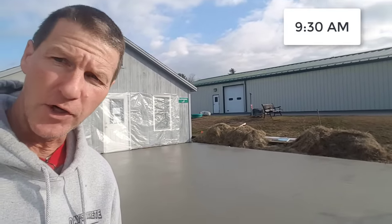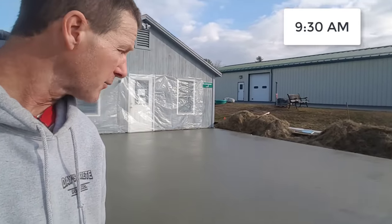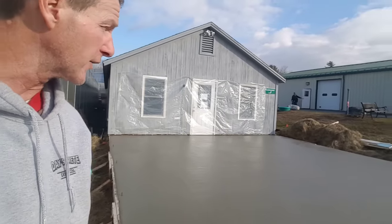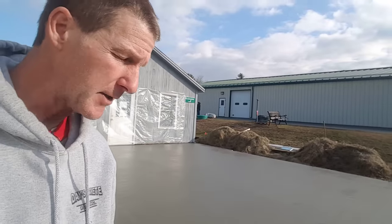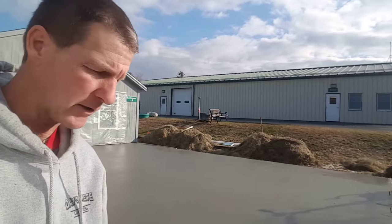All right guys, so now it's 30 minutes later from when I checked it the first time. Let's check it again. Now, a couple things I'm looking for as I'm getting ready to finish this is I wanna make sure that all the bleed water has dried up. I don't wanna finish any bleed water in there, which it has. I'd say 99% of the bleed water is dried up. And because it's kinda cold, it was 36 when we got here, it's probably about 40 degrees now. The sun is coming in and out. It's kind of partly cloudy.